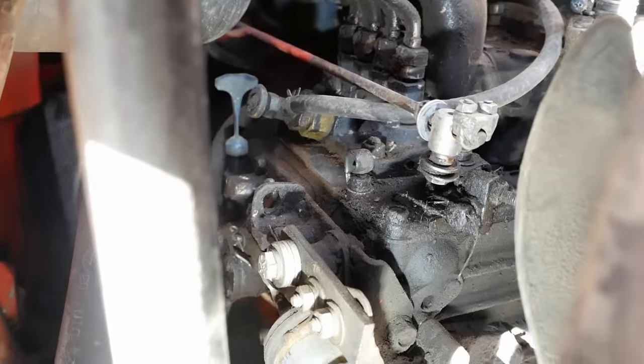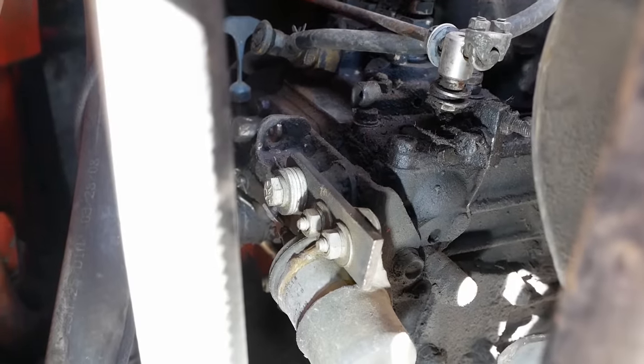And I tried adjusting it. There's a stop screw. I backed the stop screw out. Didn't make any difference. You can see on the linkage where someone's put some washers on there, trying to get it to travel further. Doesn't make any difference. Something's wrong with the internal governor. So I don't know if the spring is broken,